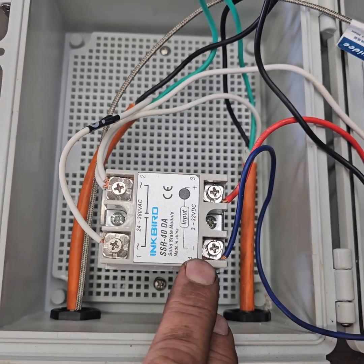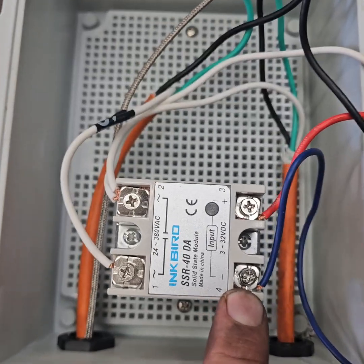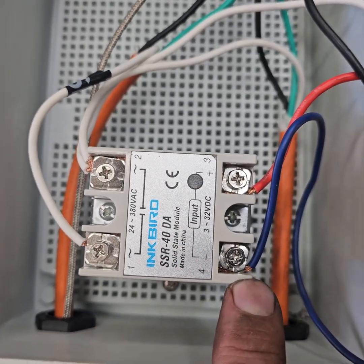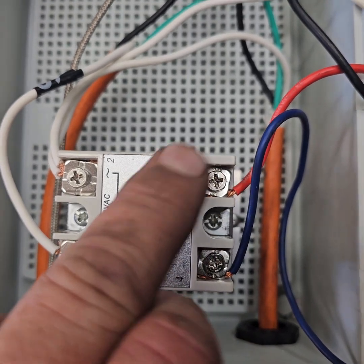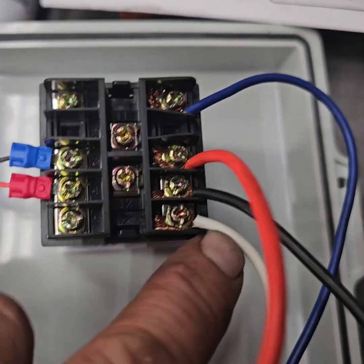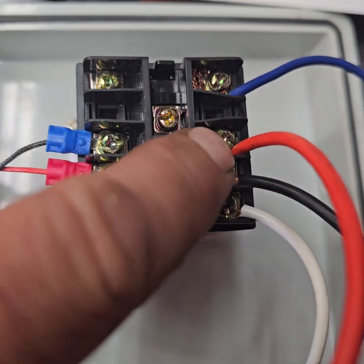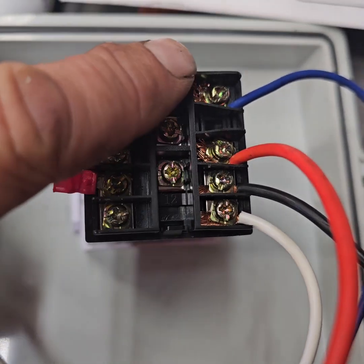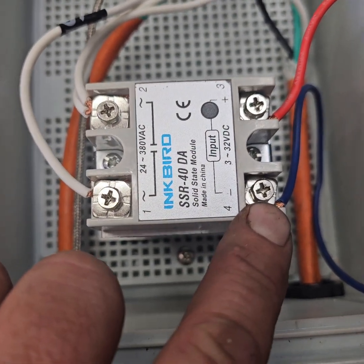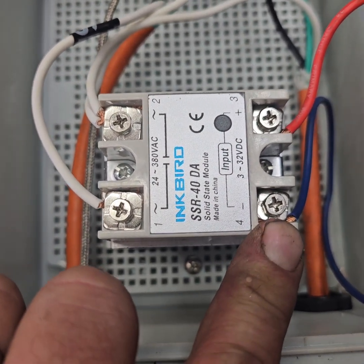The DC that turns this on and off are the blue and red wires. I used a red wire for number three — that red wire comes over here to the third screw up on this side. Then the top screw on this side I connect to my blue wire, and that blue wire goes to my negative, or number four, on the relay.